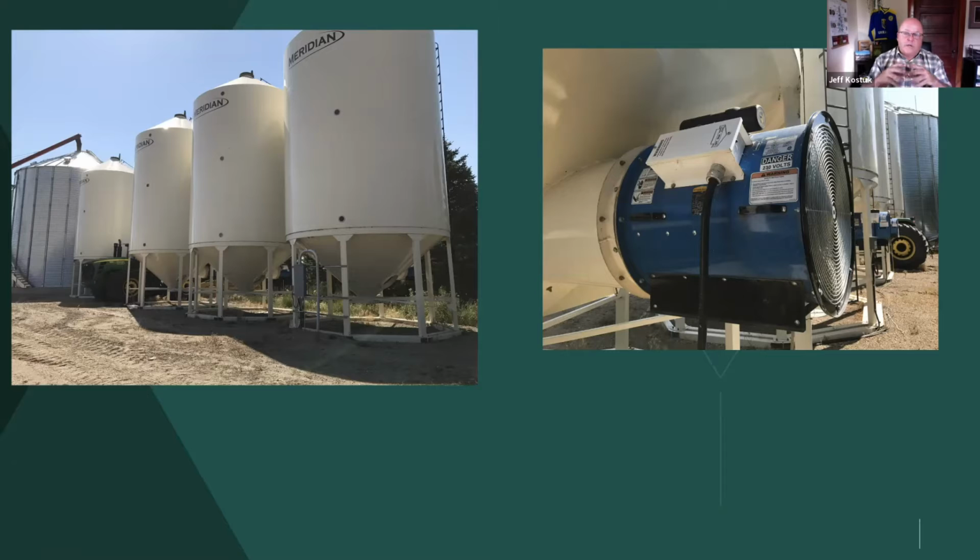as we're drying grain, there's going to be a lot of bract material within there that has a higher moisture percentage. As we fill the bin, that bract material really goes to the outside and along the walls of the bin, and air will take the path of least resistance through the grain and not necessarily dry through there. So we want to make sure that the complete bin doesn't have any hot spots in it, and we can dry. Once we get into that 12 or 13%, once that material has dried up, as we're moving the bins, if there's a gentle breeze, a lot of that material just flows off.